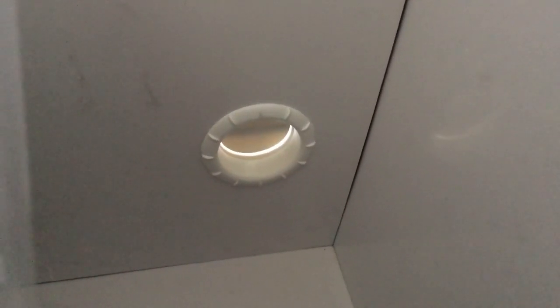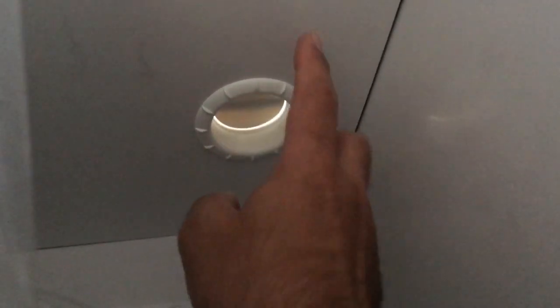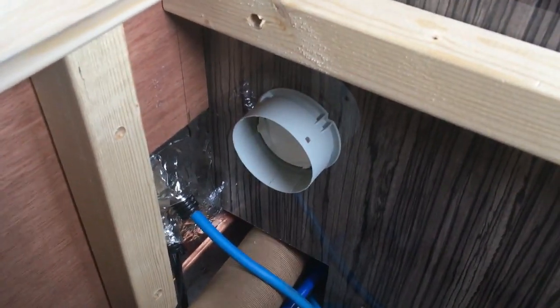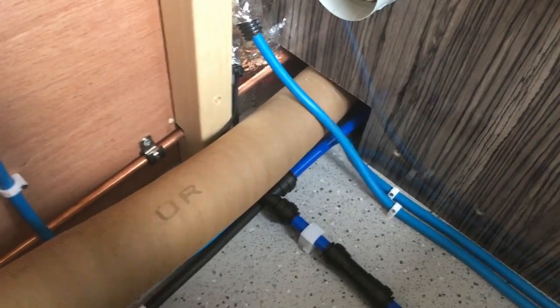Here down the side of the toilet we can see that white vent — this is the one with the little damper so you can partially close or open it. On the opposite side, within the bench seat, there's a collar, and it's going to provide warm air to our shower. The combination of warm air coming into the shower at low level and the extract running at high level means we can actually use the shower as a drying room — hang wet clothes in there and in no time they'll be dry. Here's the other side of that vent in the shower cubicle. We just need to connect some flexible ductwork from this collar to the boiler connection; the pipe already runs through the bottom of the shower through to the garage from the previous shower build.